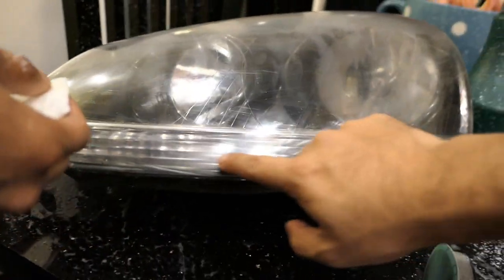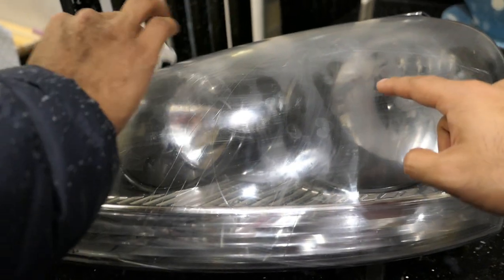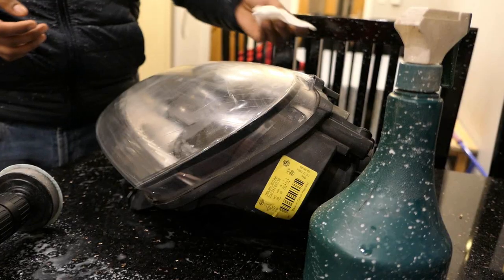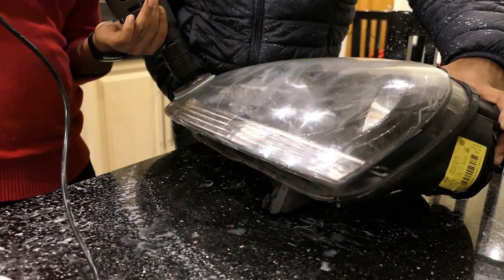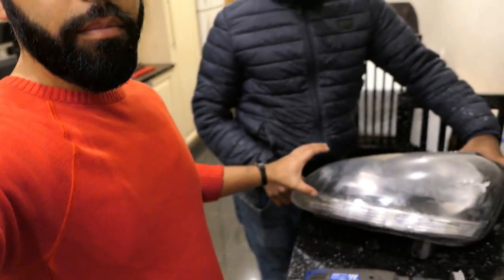You can see we've got rid of a lot of the sanding areas here, but there are still different colors going on when we dry it up - these are areas we still need to get all fogged up to the same level of fogginess, so I'm going to go over this whole part again. You'll probably notice I slow down my movement speed quite a lot when going with the thicker rougher grit - that's because you can apply more care and precision and not go too crazy.